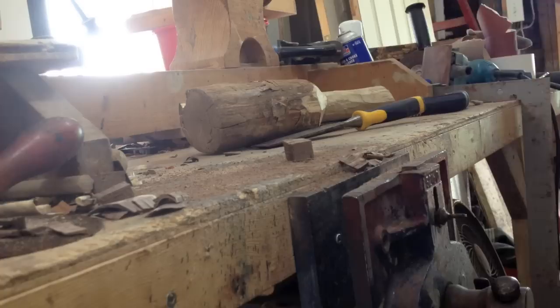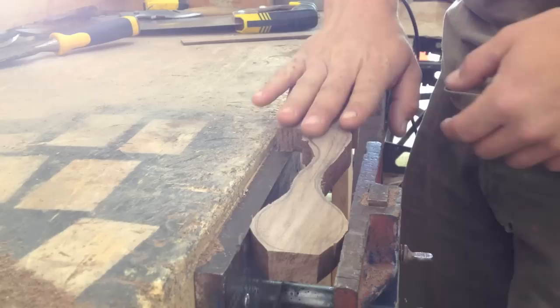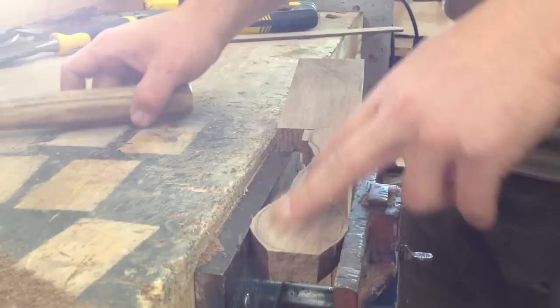There you go. That is how to basically rough out a crazy spoon like this pretty quickly. So this is where I like to hollow out the bowl. One of my methods is to clamp the handle or just any flat side to the table. Sometimes clamping in the vise puts too much pressure on the bowl and you can watch it misshape. I haven't had one crack, but it's safer to clamp it to the table, but I'm using my vise to hold the camera.